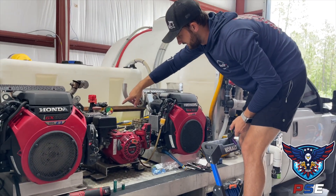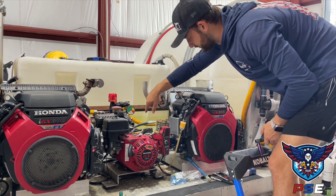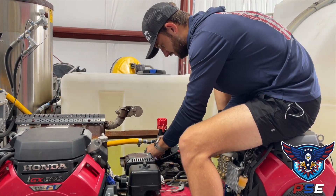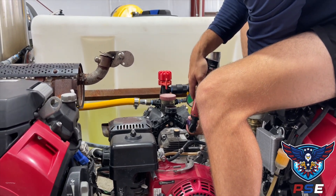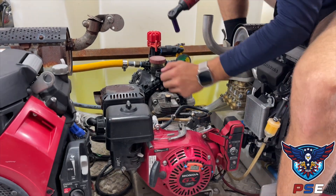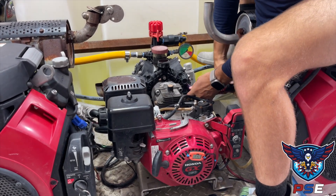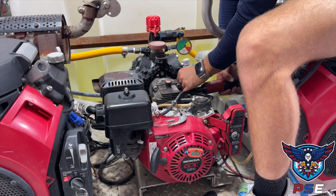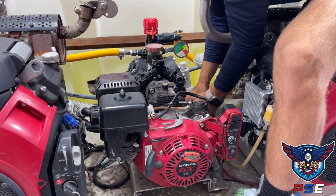Next step is disassembling the front manifold. We've got nine half-inch bolts to take off — two on each of the sections where the check valves are stored. These are pretty easy to get to on this piece here, but when you get to these others I'll show you a trick to get those out. And then there's two more on the bottom as well.